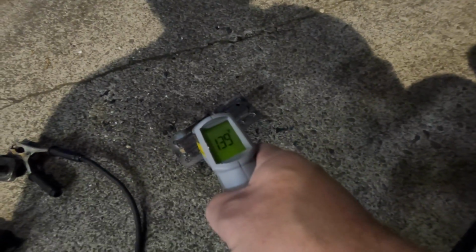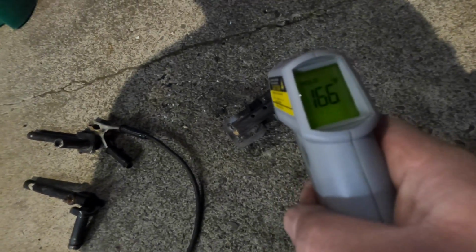So we're waiting for parts to cool. Then we're going to measure, and we're going to get those little end pieces put in there. Just stick a little booger weld on the end. Come back in here, measure it, make any adjustments if necessary, and then zip the whole thing together. Still a little bit on the hot side. It actually went together a lot better than I thought.